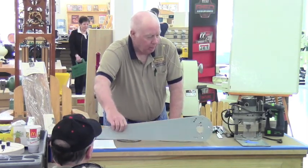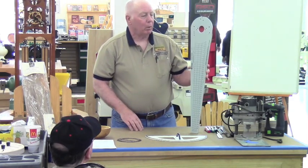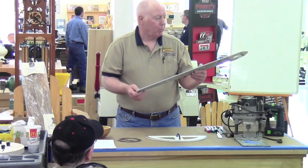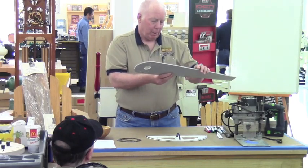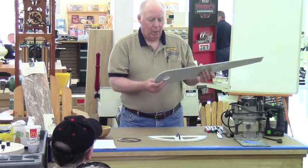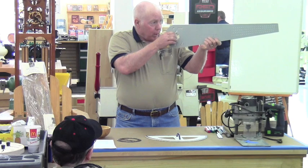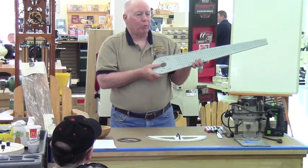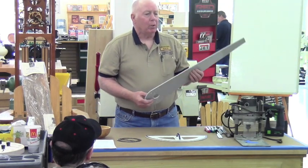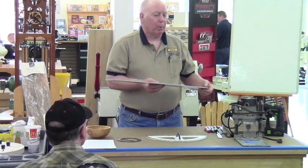This one will make up to about an 18 and a half inch circle. For anything bigger, there's a Jasper model 300 that does exactly the same thing — it's just bigger. I think it will make up to about a 52 and three quarters inch diameter table. These jigs fit just about any router ever made. The Jasper jigs are right over there on the wall. I found a compatibility chart on the jaspertools.com website — know your router model, like a Porter Cable 690, and it'll tell you whether this jig will fit.